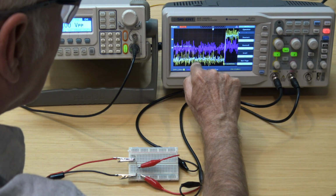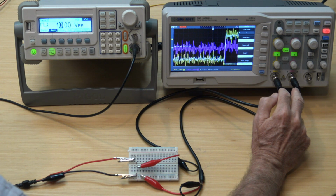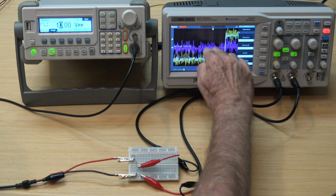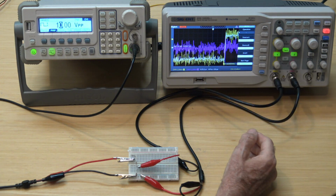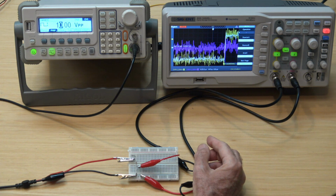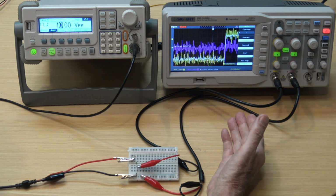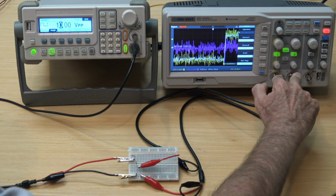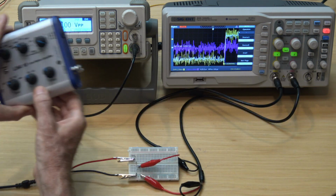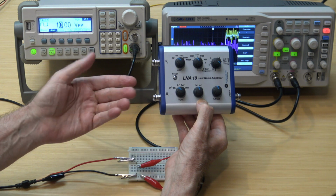This is because the two oscilloscope inputs are digitized first and then subtracted, but there's only 256 levels of digitization. You'll need more like 1,000,000 levels for reasonable noise cancellation. Of course, an analog amplifier can achieve that level of precision. Also, these two amplifiers need to have the same gain with very tight tolerance, which is not the case with an oscilloscope. The two gains in this amplifier, however, are matched to within 1 part in 100,000.